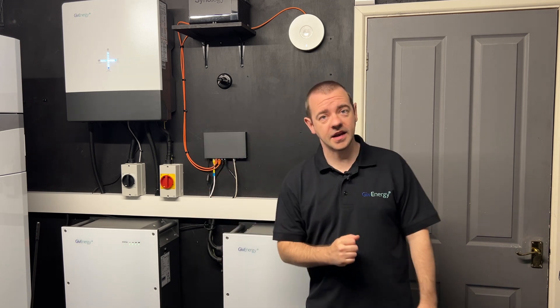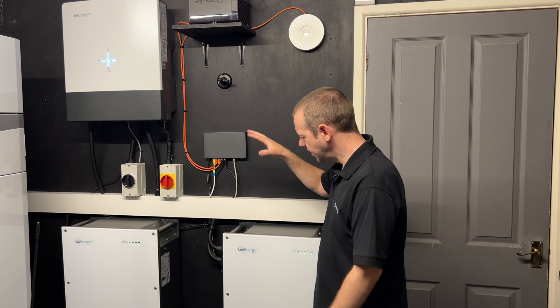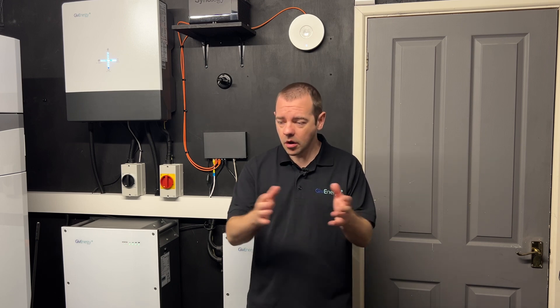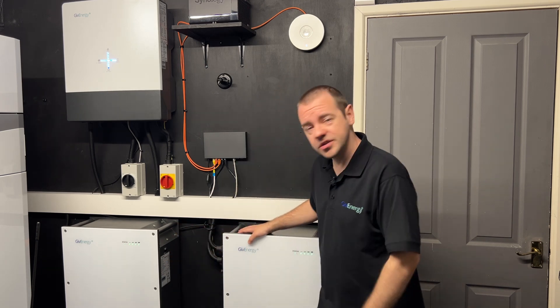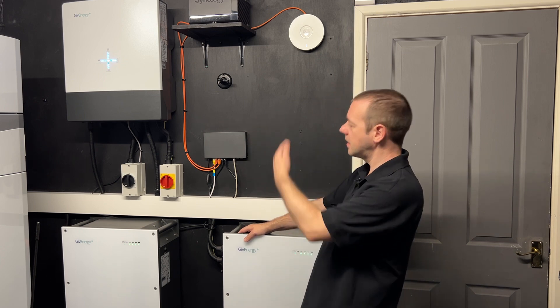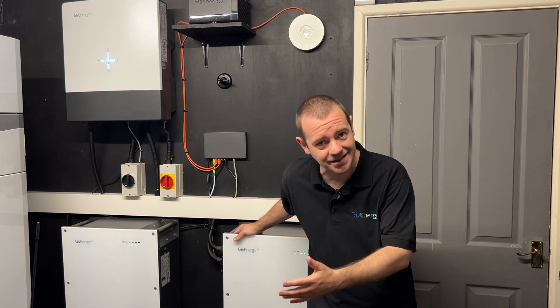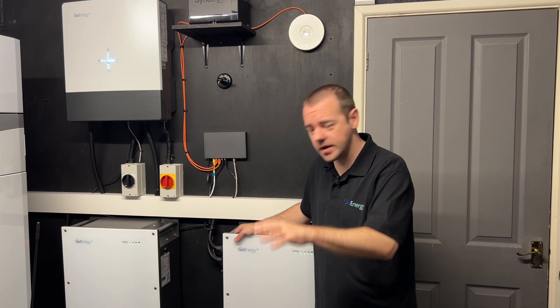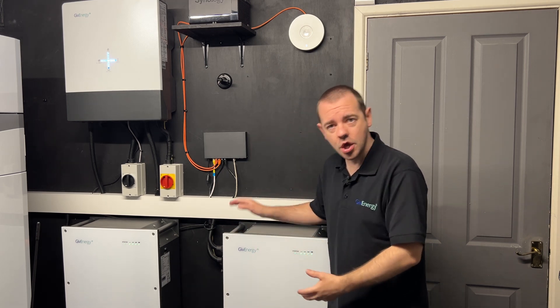During the winter months, because we have a full electric household — heat pump and so forth — that's why I bought these batteries. My batteries charge up at night when it's cheap and then discharge throughout the day to power the house. Which means they're getting a lot of exercise — in winter my batteries are ripped, but in summer they're just sat there fully charged, not really doing anything. Not everybody uses a time-of-day tariff or even has access to one. There are a lot of people where in winter the batteries are sat there doing nothing because there's not enough solar to do anything. So whether it's summer or winter, whether fully discharged or fully charged, get it doing something.